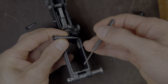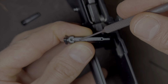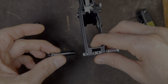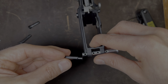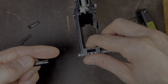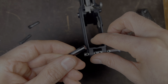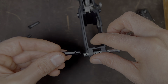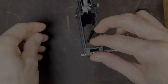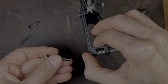Now we're going to replace the clevis pin with the new pin. The detent that's in here is going to go right into this channel. We're basically going to do the same thing we did to remove the pin but in reverse. When you replace it, you're going to push the new pin against here and keep pressure on the clevis pin as well. You have two pressure points — pushing to the right and pushing back the other way — because the detent is creating pressure against the pin. I like to keep my thumb here while pushing over, since we're pushing the clevis pin out with the new pin.